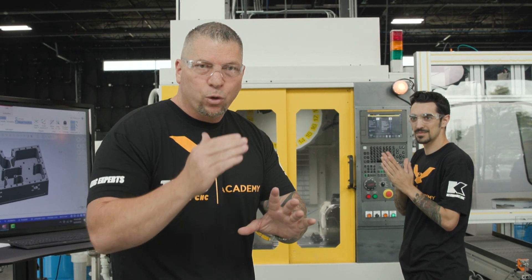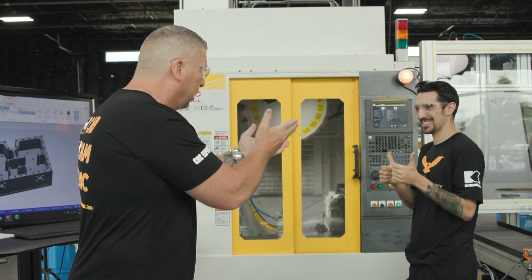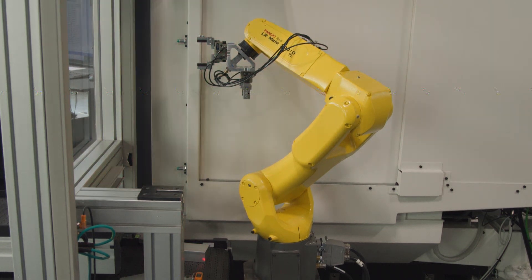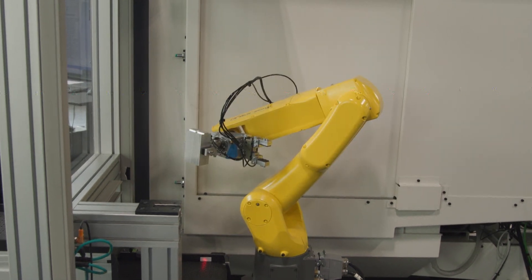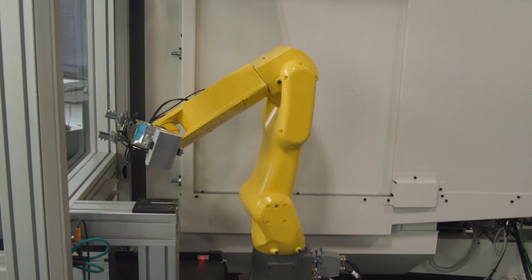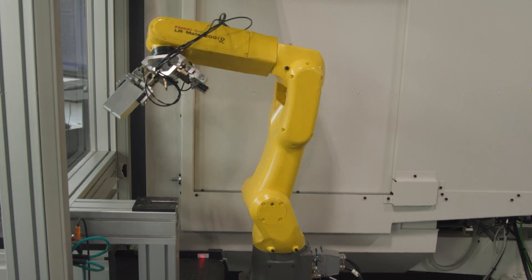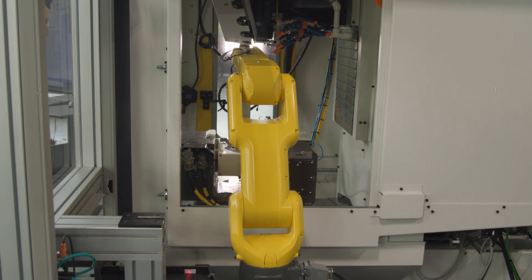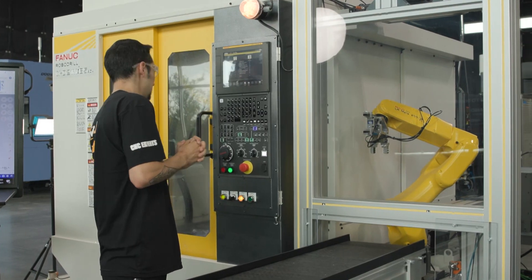Without further ado, we're going to start the process quickly and then go through the show while the machine runs on automatic. I have a piece preloaded in there so we'll get there quicker. Just hit the sensor — that's my infrared picture. I'm going to take one more picture to see where that dovetail is, because with the Schunk vise we have, there's a dowel pin in there and it can only go in one way. Now we'll be going in the machine. Dowel pin set. And now we're machining.